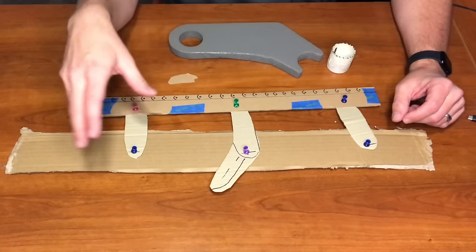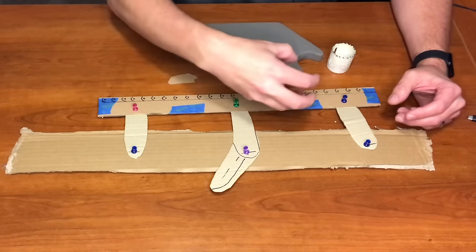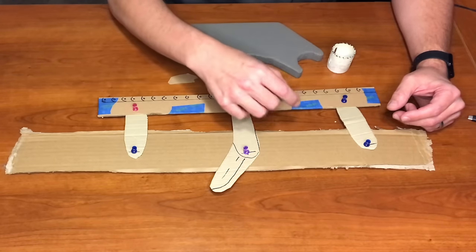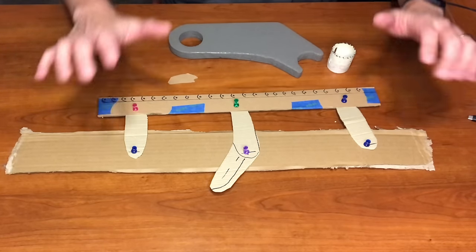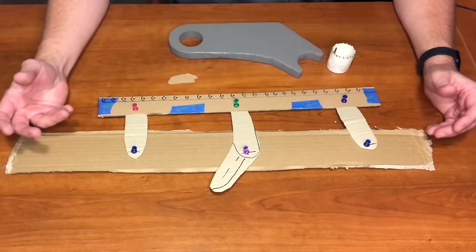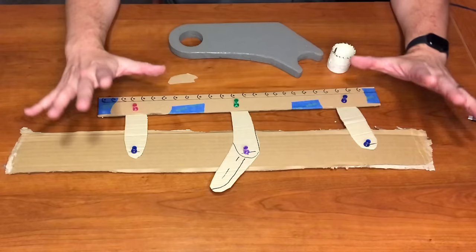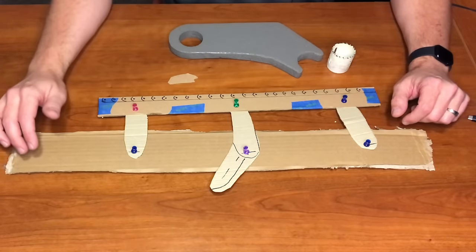Original from the manufacturer, Vekoma put on there simply just rubber bumpers. It's just a chunk of rubber, like a giant pencil eraser, that the whole trough would just land on all of a sudden. But if you get a little bit of an upgrade, they put Enidine shocks up there to absorb that slamming down.